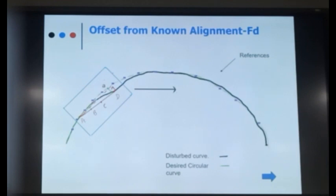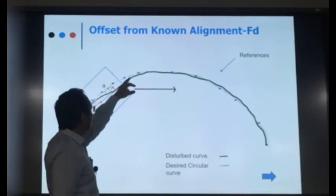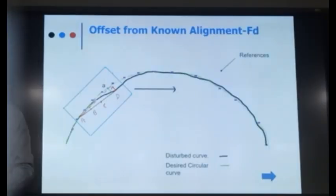this total station gives three things. The northing and easting will give you the x coordinate, and z will give you the vertical coordinate. So the coordinate of the point in space will be known. If you know these center line coordinates, which are shown as cross lines, then you go to the field and measure the center line coordinates for the existing track. The difference of the two will give you the slew. And there are softwares which can convert these northing and easting into x and z values. Existing x and proposed x are different, it will find out and give you the slew directly. And that difference will give you the amount of lift required to be given.